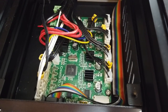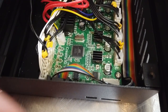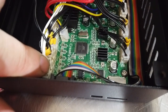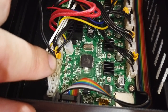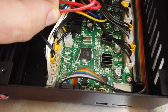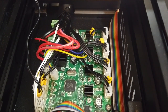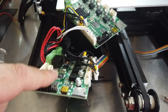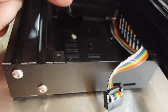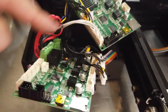Here is the brain board inside. This is your end stop switch — probably easiest to unplug that and get it out of the way. What we're going to do is transfer these wires one by one to the new brain board as we unplug everything. This will reduce the chance of messing up where they go. They are all marked — if you look carefully there is writing on the board that tells you what each connection is for. For fans, polarity is important. For heater cartridges, polarity is not important. For everything else they are keyed plugs — they can only go in one way. A little pro tip: remove the screws from the old board first — the four screws that hold it down — and there's enough slack that you can pull the entire wiring harness out a bit, giving you much easier access to the entire board.